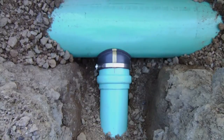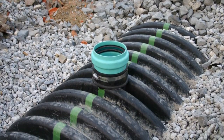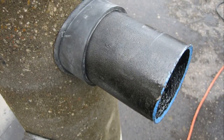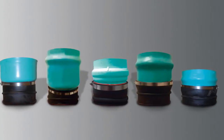Insert-a-T can also be used with any sort of lateral pipe from 2 inches through 30 inches, such as PVC, Schedule 40, corrugated HDPE, C900, or ductile iron. When you need a lateral connection, Insert-a-T offers a compression fitting that's testable and easy to install.